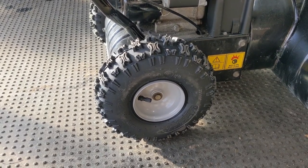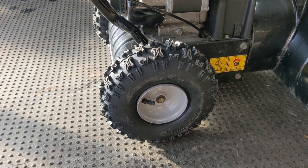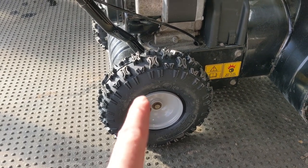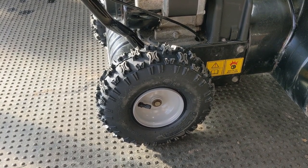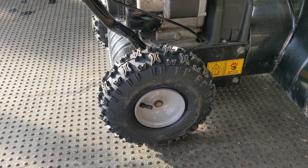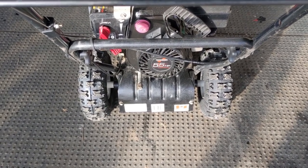Changing out these wheels is pretty straightforward. You simply undo the bolt, slide the old wheel off — it should not be rusted to the metal axle because the old wheel is made out of plastic. What I would recommend is putting some nickel anti-seize or some type of marine grade grease, or even low temperature grease such as an NLGI number two, onto the axle shaft before you install the new metal wheel. And just like that, you'll now have two brand new wheels and tires installed on your machine at no cost to you.